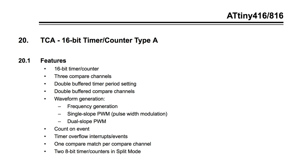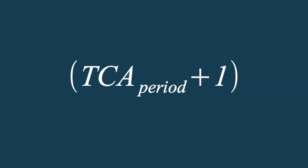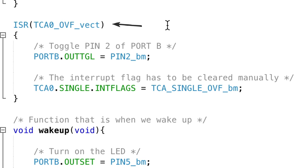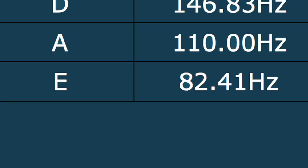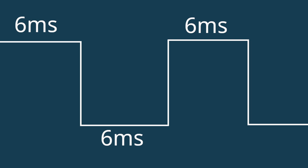The passive piezo is connected to a pin on the ATtiny that has a 16-bit timer. By changing the timing on that channel I can create different tones. This is where some math comes in. If we consider standard tuning we can make a list of frequencies we want. The low E string has a frequency of 82.41 hertz, the A string 110 hertz and so on. The frequency of our output is determined by the period of the timer. One cycle of our tone is made up by two equal periods to get a 50% duty cycle square wave.